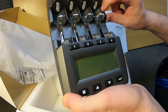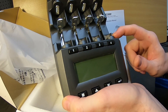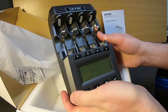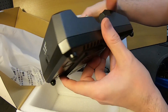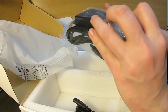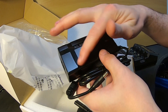What do we have here? Maybe it's a thermal sensor — that would be so cool. Since this one can actually charge at like three or four amps, it's good to have a temp sensor to turn it off if the cell gets boiling hot. How cool is that? 12 to 18 volts input. And the power cable — it doesn't have built-in AC. This is a really heavy adapter, an AC switching adapter, almost looks like a brick.